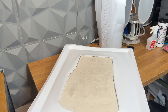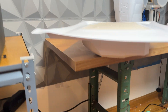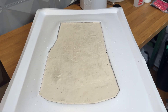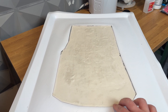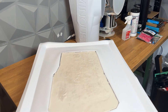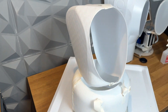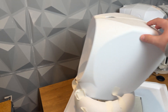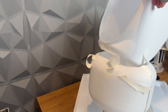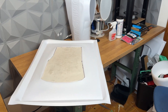Here's what it looks like upside down — this is the side that was facing the plate, and you can see how it looks down here just to orient. I'm not going to show actually getting these separated because that's a bit difficult, especially because I had neglected to remove some of the indents up here, which were designed for cutting this to the right shape so that it fit the robot properly, so I'm going to have to wrestle with this for a while. I used to just put things in the freezer when I was making my original prototypes — they were small enough that if I just popped it in the freezer and took it out, it would slide right off the plastic buck. But this is far more cumbersome than what we now have. Yep, that's some vacuum forming.